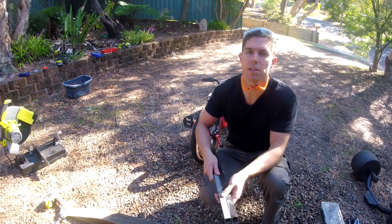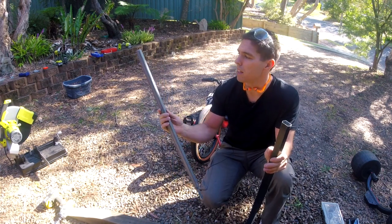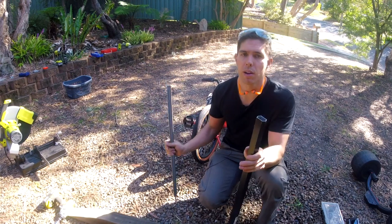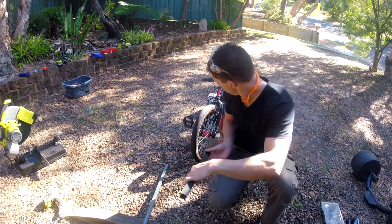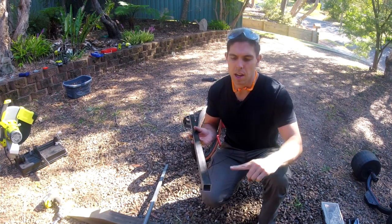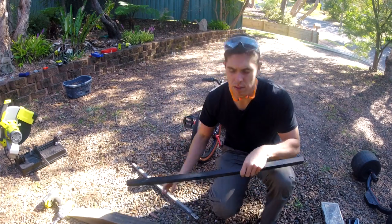Got these two materials in roughly the same size. One is aluminium. It's very light, not as strong as this, which is mild steel galvanized. This is left over from an old athletics hurdle. I'm gonna see if this one is gonna work, only using nuts and bolts. And to start that, I have crushed down the end. I'm gonna feed it into the slot. I might apply a slight bend outwards and then a bolt through for the foot peg. And if it's not strong enough, I haven't wasted too much time, hopefully, and I can come back to these.